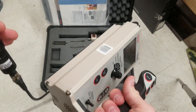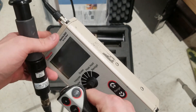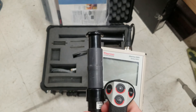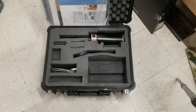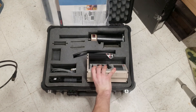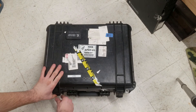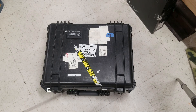There's not much else to say about these. When they work, they're nice meters — nice, simple, and they feel rugged. They're three pounds by themselves without batteries, all die-cast aluminum. But they can be tricky to use, tricky to maintain, and they don't always last the longest because without the calibration data you can't really do anything with them. Anyone who buys one without a probe will probably find they can't use it because they don't know what probe it wants — it could want a pancake, a scintillator; there are three chances and all three could be something different. But they're nice kits — I like them, they work, they sound nice. I'm going to do some more filming of these, especially during detection.